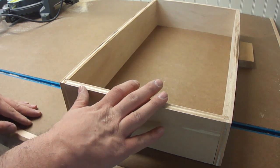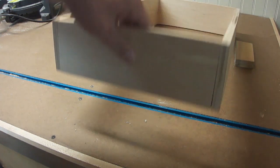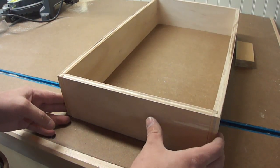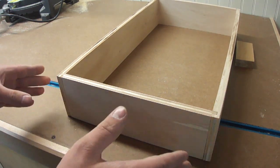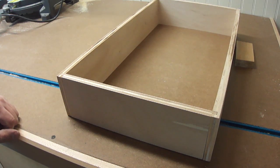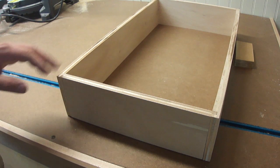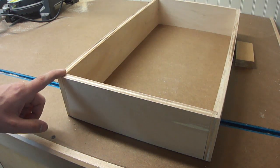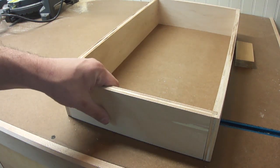The only thing we have left to do is give this drawer a bottom, because right now it's not going to accomplish a whole lot the way it is. I like to wait and not cut the piece of plywood for the bottom until I have the drawer all together, so that way if there's some slight variation I can take care of that when cutting the bottom now. You've got some options when choosing a bottom — if this is going to be subjected to a lot of heavy tools, a half inch bottom is often the way to go.